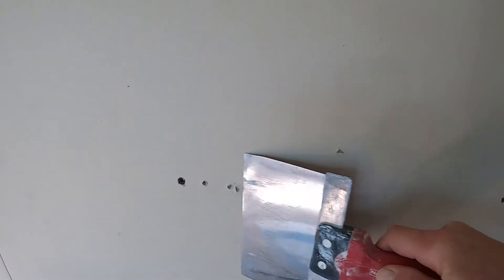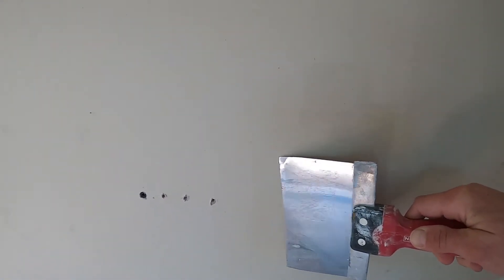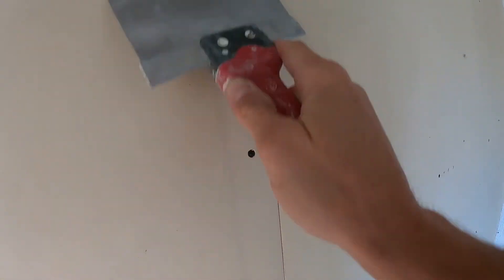The first thing we want to do is take the knife and scrape some of these screws — especially the misses where they couldn't find the stud. We're just going to go around and scrape everything to make sure we don't have any proud screws or boogers sticking out that we'd have to combat while mudding and during subsequent sanding. Everything else looks pretty good for the scope we're covering today — I'm just going to do a small section here to give you a good example.